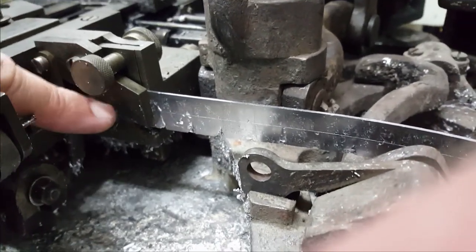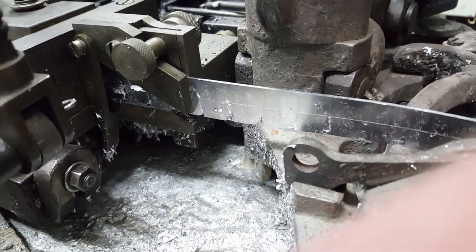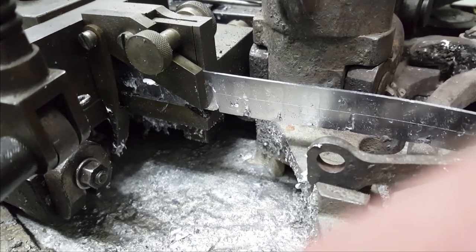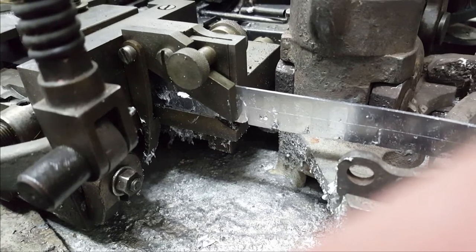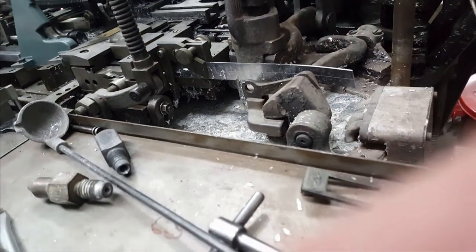This arm here was pivoted out more this way, and it looks like it's supposed to just push the jet down, but it just added to the clogging effect. That means the mold blade wouldn't feed the metal out of the mold, so it would stop casting. So there's some tuning to be done.